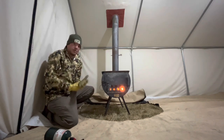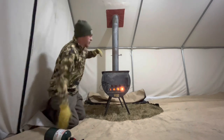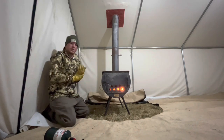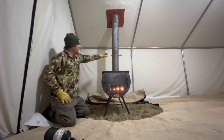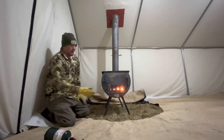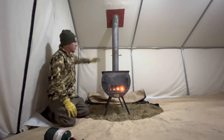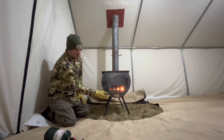Another really good tip with the Sleepmore Mini or Max is you want to control the airflow. When controlling airflow with one of our stoves you have two options: your damper and the front vent. I leave the damper completely vertical — up and down — and I don't touch it. I control all my airflow with the front vent. The reason I do that is I can physically see what I'm changing, whereas it's harder to see that with the damper.